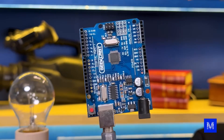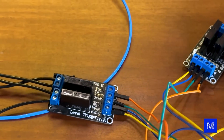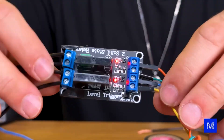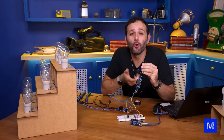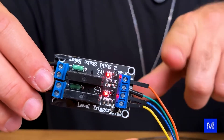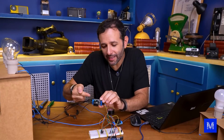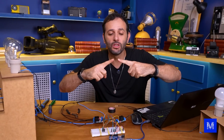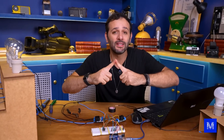We'll use our friend Arduino to control this. It's an Arduino Uno — the most common Arduino board — with a breadboard and two solid-state relays that have two outputs. The whole secret is in the relay: this small piece contains a switch that can be controlled by the Arduino. On one side is the smart control which communicates with the Arduino; on the other side are two switches where actual electrical power from the outlet comes in and goes out. The Arduino opens or closes this connection — it turns the lamp on and off.